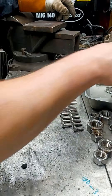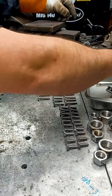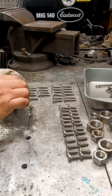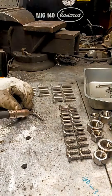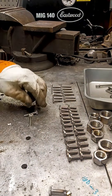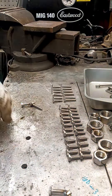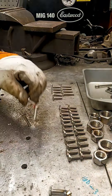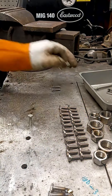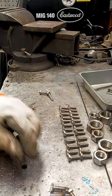I have 2 partial holes drilled out in my worktop which works perfect. Simply put the first bolt in and it acts as a holder until you can get the second bolt welded. Laying them all out and organizing is important for me so I can keep track of which parts belong to what. I end up tacking both sides of the legs, once in the front and once in the back. This gives it enough strength to hold and not break or fall off at the weld, even when abusing it during the cleaning process.